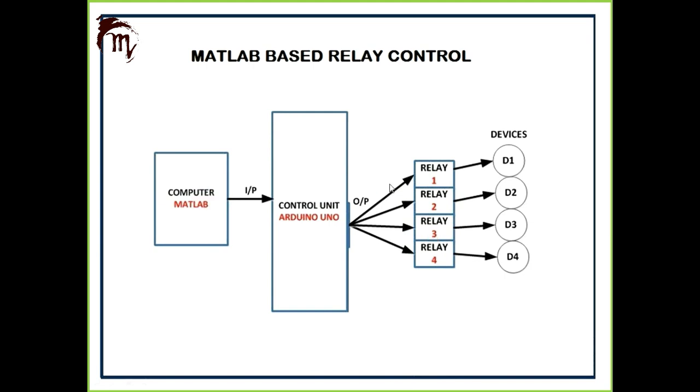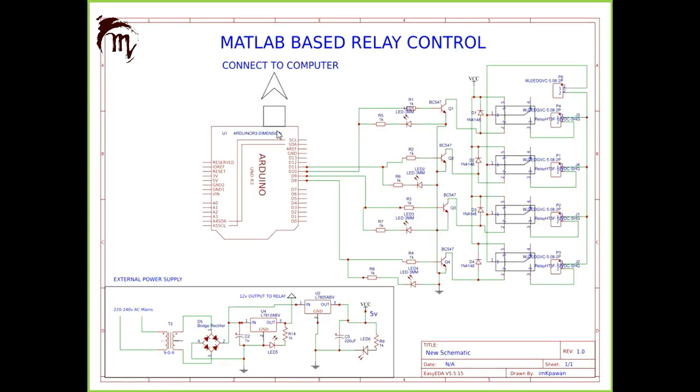I will use this circuit diagram where I will connect my Arduino UNO to my computer. This is the bunch circuit which is nothing but your relay and driving circuit. I will use a ready-made relay driver which is already connected with this driving circuit and some relays. I am using a 5-volt relay here; the circuit diagram has been given for a 12-volt relay. If you are designing this circuit you just need 12-volt relays to complete the circuit, or you can replace it with a 5-volt relay, which can be powered by your Arduino.